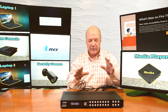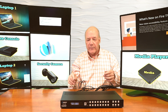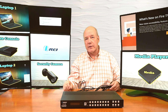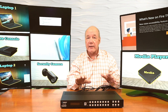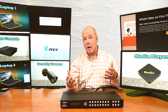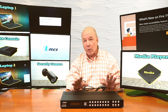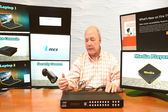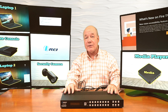The beauty of the product is that I can redirect any input to any output at any given time using the buttons, the infrared remote, through a GUI over the network, or through a direct RS-232 connection. The unit will upscale and downscale as needed to accommodate the input versus the output. You can also enable ARC audio, and you have complete control over the EDID settings as well — all accessible through the front menu, the GUI interface, or the direct RS-232 connection.